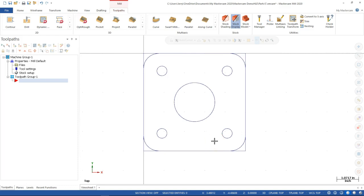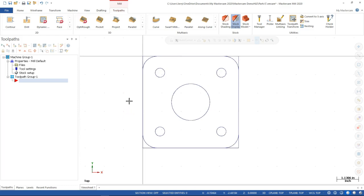All right, so if we go around, 3-inch length of cut, carbide tool, running even on the light duty machine is going to be a little bit of hogging to take that material. All right, so if I overcut this by maybe 1/8 of an inch, it means it's going to be fairly light across the backside, fairly light across the front, and then both sides will have somewhere between 40 and 60 thousandths of material to remove. I can't say that I'm going to be able to take that all in one contour, but I should be able to either do the ramp or the step and repeat as a rough, and then when I bring it back to finish, we can work around it.